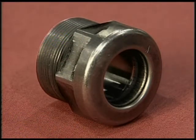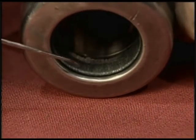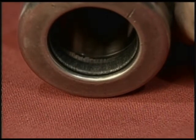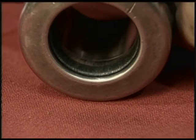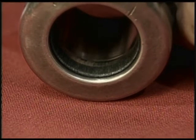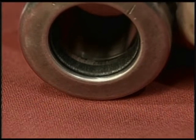After excessive use, the anvil may form a wear ring, as you can see. This groove indicates wear. Notice the lateral striations. It can cause excessive friction between the anvil and collar. Excessive friction can lead to an incomplete swage. You can also see these striations on the collar. This indicates it's time to change the anvil.